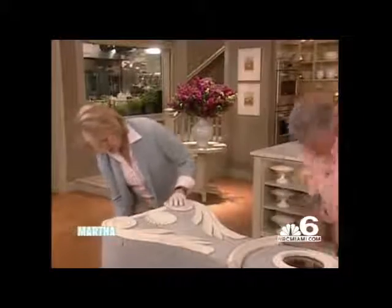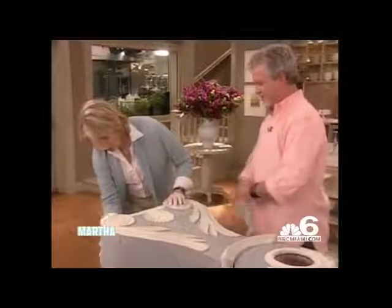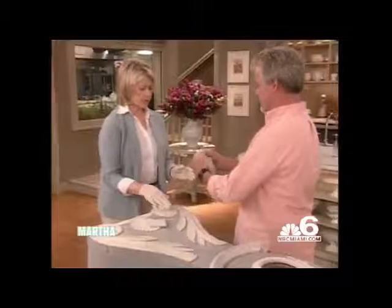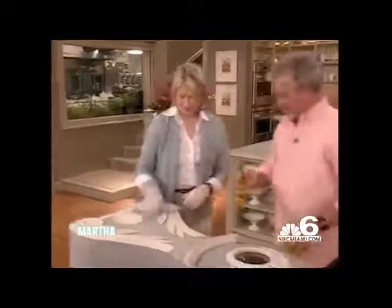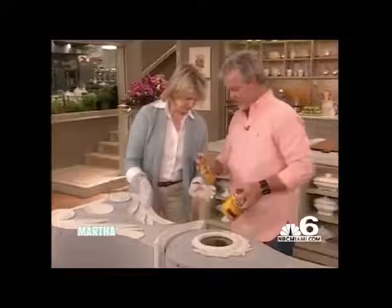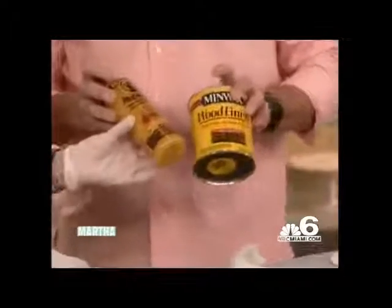And this definitely is old. Yes, it's a very old clock. It's beautiful. So then, what's that? You're going to wax. There you go, the sock. We use an orange base. Even though we haven't really finished, that's no problem. Orange base beeswax and a Minwax stain to give it the character: 80% wax, 20% stain.